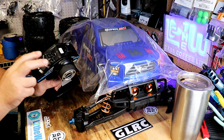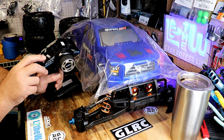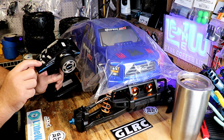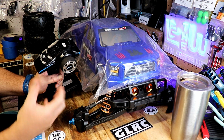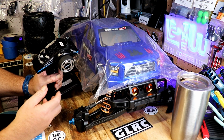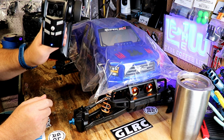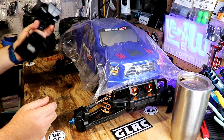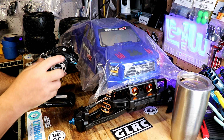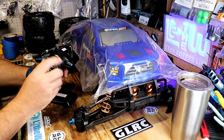I believe these two here are for reversing the servos, because it looks like throttle reverse, neutral, something. And then here's your trim setting, with an arrow on either side, so that's your steering trim and throttle trim. Which seriously, with electronic ESCs, you don't need. And then you've got a dual rate right here, a little power button, a little on LED. Like I said, just very, very cheap. I'll use it for the initial get-go, but after that, it's gonna go in the closet with the rest.